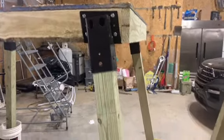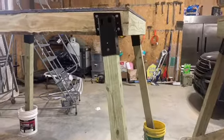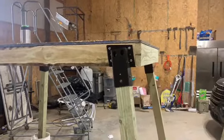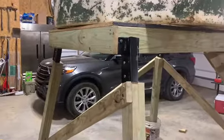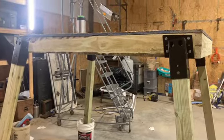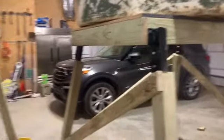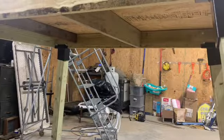I bought 10-foot four-by-fours, cut them in half, then built a two-by-six frame. I have some old free five-eighths OSB with the silver on top. Those blinds are four foot wide by six foot long, and you can see the tote there - it fits on there, just slightly braced right there.